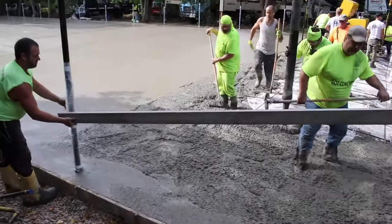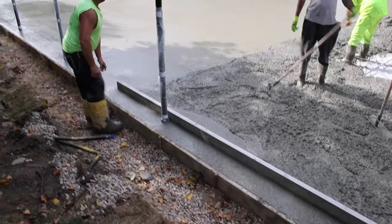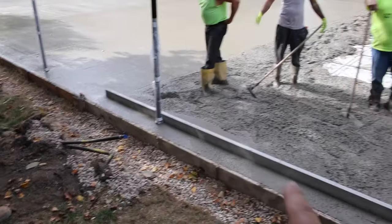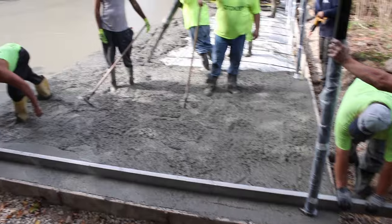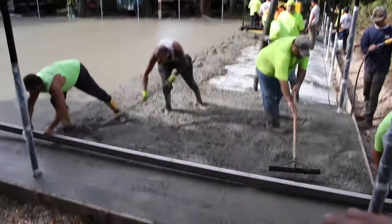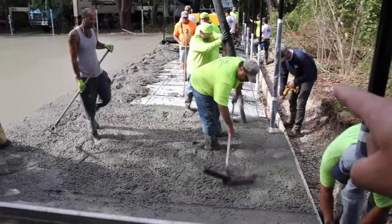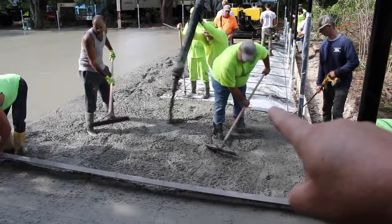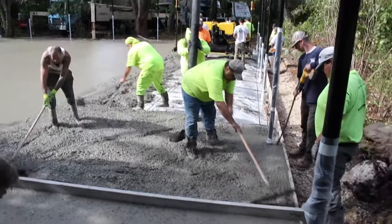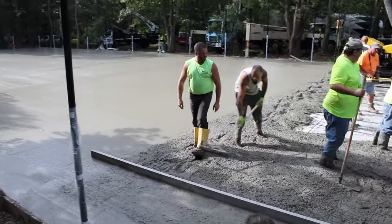This is the first time I'm seeing this process happen. It looks like they're setting up a manual screed right now where the laser screed can't get in. They'll travel this edge and work this piece of metal screed back to get the surface started so the machine can come up and pick up on that surface and work its way out. You can see one guy's on the vibratory working the punch on the side. The perimeter of this entire court has 10.5 to 11 inches of concrete while the entire field of the court has six inches.